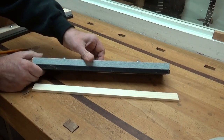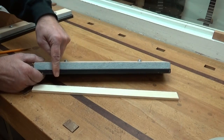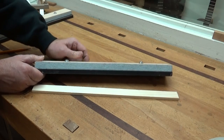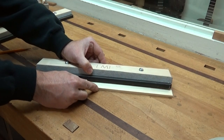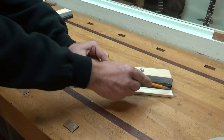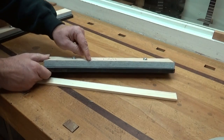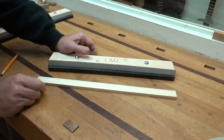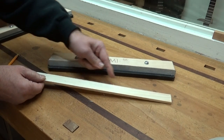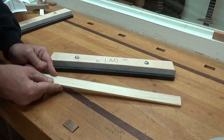You'll notice that the same radius that's here is also on this part of the jig — that's called an HDPE base, which is just some fancy lingo for hard plastic. I'm going to place that over the top of my brace and trace that radius on there. I'm going to use the 15-foot radius on this jig for demonstration purposes, then take this either to my bandsaw and trim it close to the line, or use my hand plane to trim it close to the line.